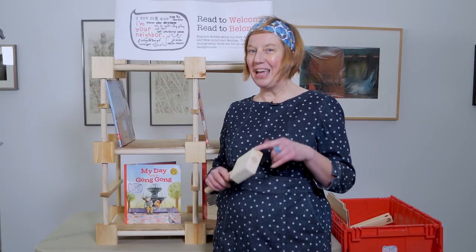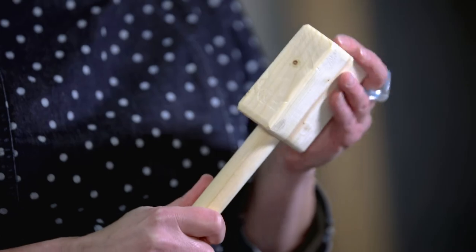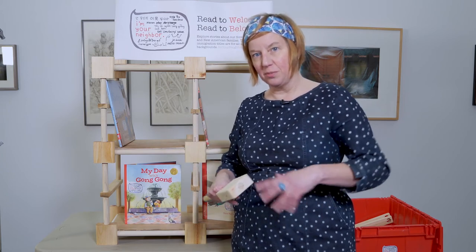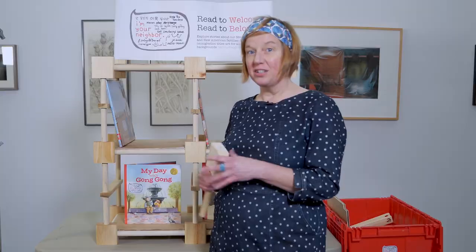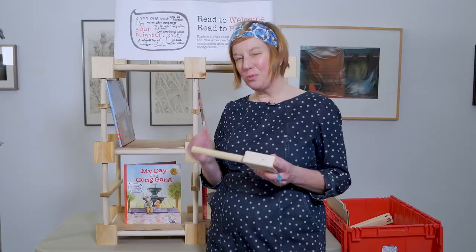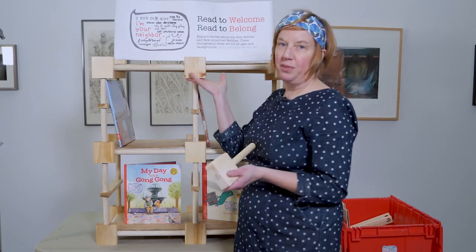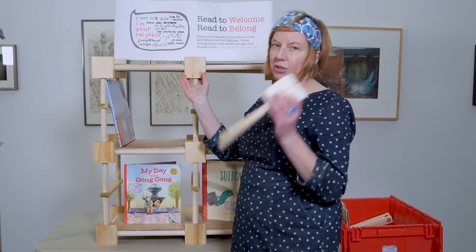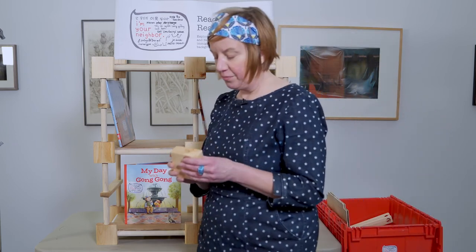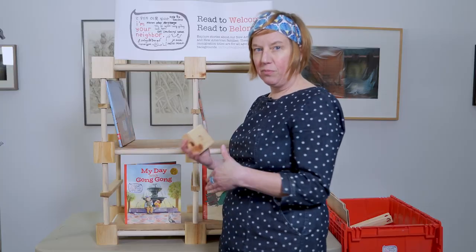You may find in your box a little rubber mallet. Here's the mallet that's been made out of our pieces. I would not use it on assembly — we're using our body weight to sink everything into place. Don't use the mallet to whack everything into place because eventually you're going to get some splitting of the wood. What these are for is when you go to take it apart — sometimes a little tap tap will help these separate a little easier. So really just a slight tap when you're taking it apart, and if you don't have a mallet of any kind, these wooden pieces actually work well too, just to give a tap when you're breaking it down.